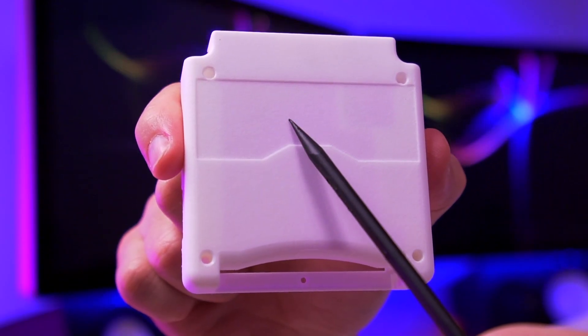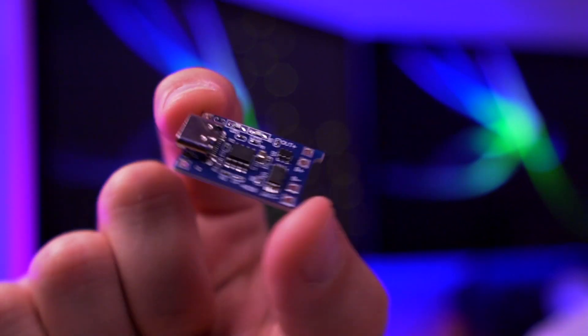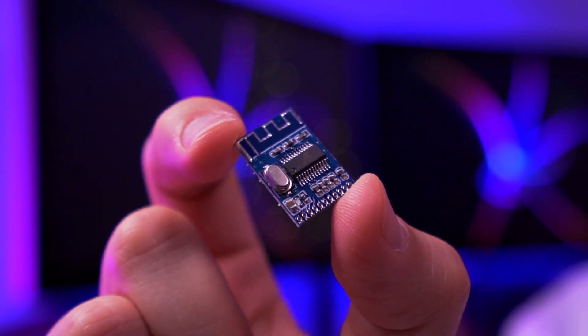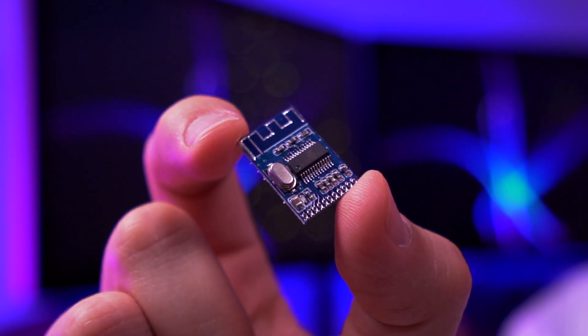On the rear of the shell there is an indentation to accommodate a label. There is a lot going on inside this rear custom shell, but let's move on to the other components. This here is the USB-C charging board — a very common off-the-shelf component. This will allow us to charge the SP without the need of a proprietary Nintendo charging adapter. This is the Bluetooth module I'll be using — it's the same one I used in my previous Bluetooth mod video for the Game Boy Advance SP. I'll link to that video in the description below.